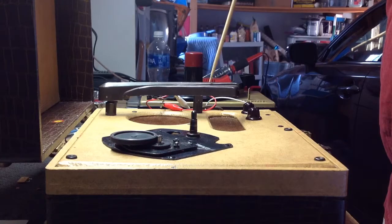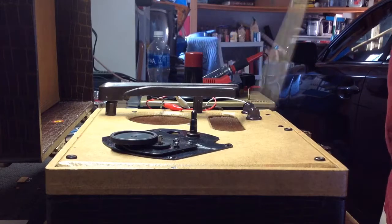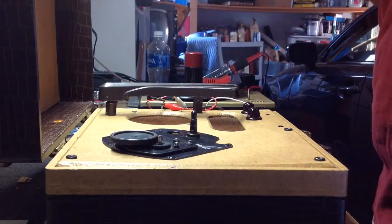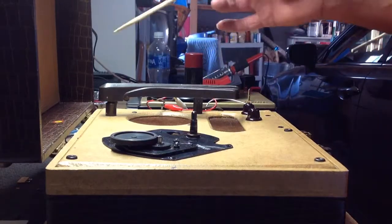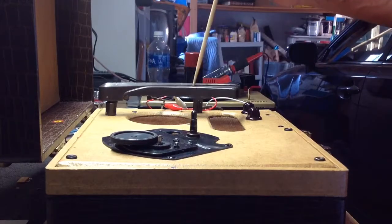The cartridge that I'm going to put in here is at least 1.2, could be anywhere between 1.2 and 1.8. I bought it from Voice of Music, and he has that disclaimer on there that the voltage on the 89T is anywhere from 1.2 to 1.8. So it's going to be more than double what this is. We'll get a real test when I get that in there.